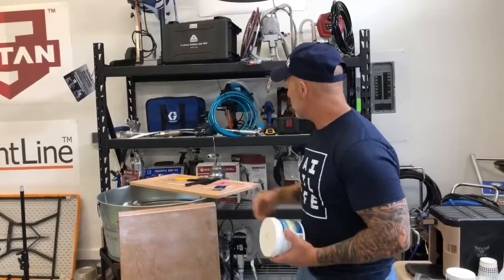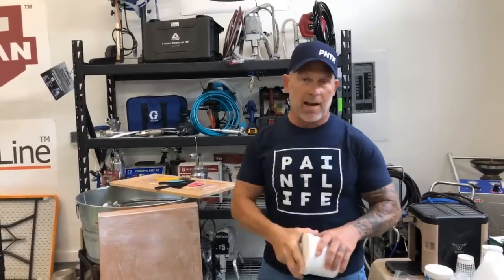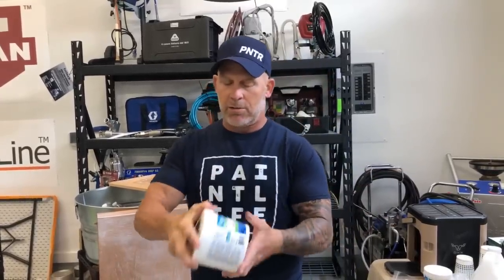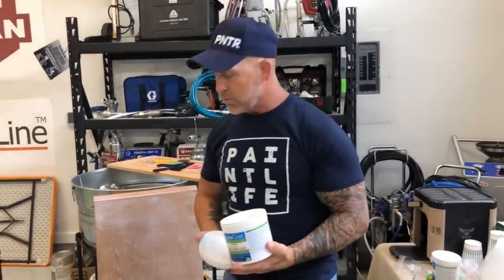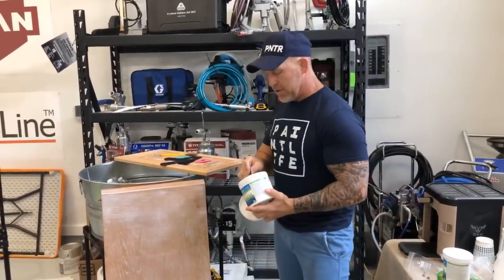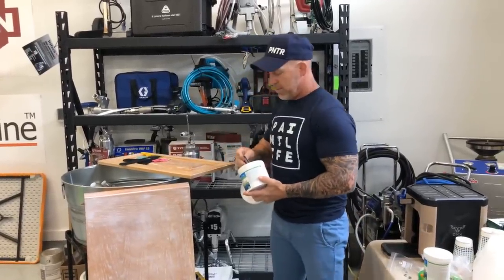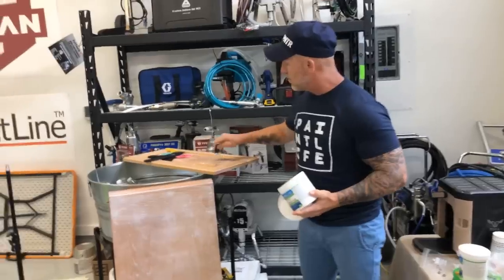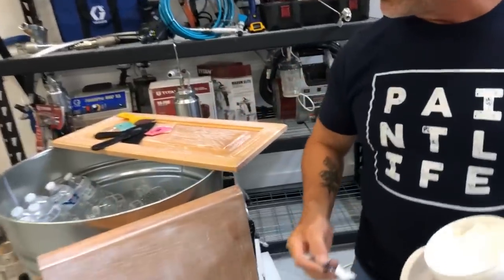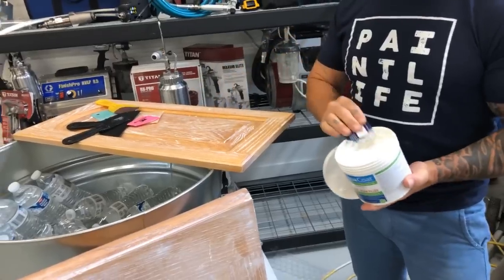But Aqua Coat is one of the products that we use to eliminate grain. Here's the product right here. I'm going to show you up close. This paste is really cool. You can use a credit card, this is a simple little credit card, and you just put it on and scrape it around, and it fills the grain. There are a lot of different ways that you can use it. You can get a close-up of that right there, showing what it looks like.